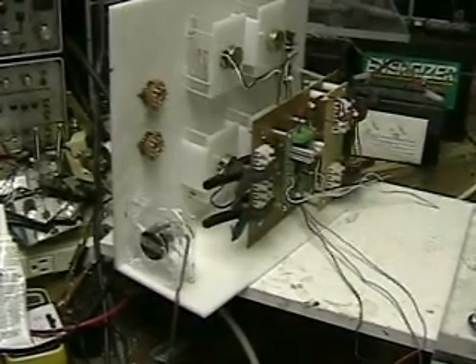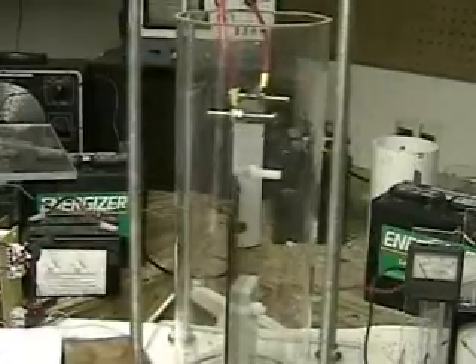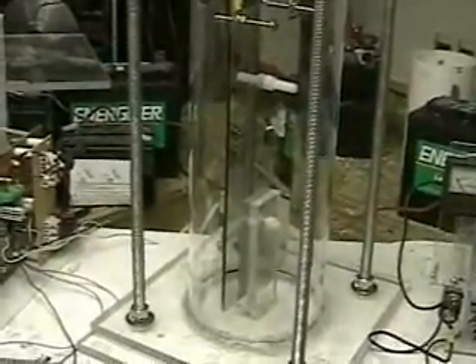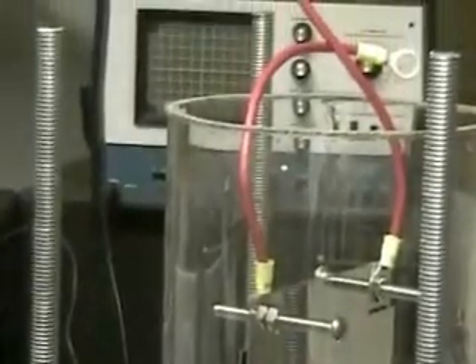You can see how it fits together there. I'll be using a 12-volt supply to run it and we'll be putting out a few more amps. There's a good view of the test cell I'll be using — it's 12 inches long, there are two plates, and it's about 6 inches wide. The idea is to use the plates that we have as a baseline: know how much amperage it takes to make the hydrogen and oxygen, and go from there. If we get the pulse system working, we should be able to bring the amperage way down and produce just as much gas as we're producing now.